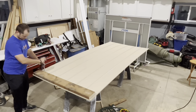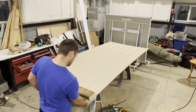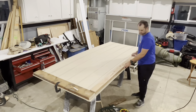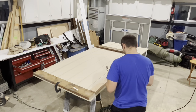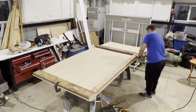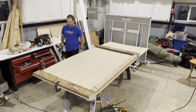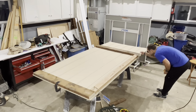All I'm doing here is taking my cuts and putting them up on one of the paneling pieces. I actually have both pieces of panel stacked here to do the cuts and make it easy. I want to lay it out and get the framing kind of set in so I can get an exact measurement for cutting the panels. These aren't cheap panels, so you don't want to mess it up and waste another $40. I'm setting the framing over the edges by about an eighth of an inch on each piece so that when you make the cut, it's set a little bit off the edge of the framing — you don't want an overlap that's going to hit the edges of your shed opening.